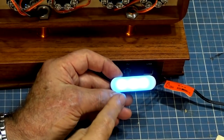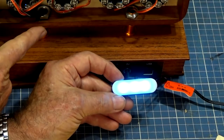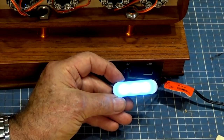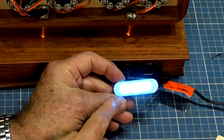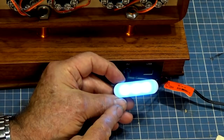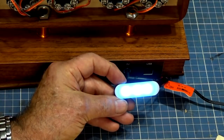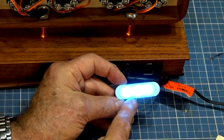Okay, I've powered up the module and it's attached to this other project. Now, you haven't seen this yet. This is actually a 7-segment display clock. I've already put one up on my channel that I call a Vixie clock, and this one's similar. It's got a different packaging, and I thought afterwards that I could put this backlit logo in the front of the clock. Now, these three LEDs are the end of the string which light up the 7-segment displays in the front of the clock, and whatever color the front display is, this module will show the same colors.